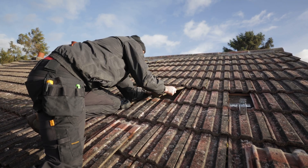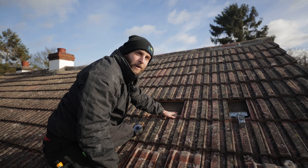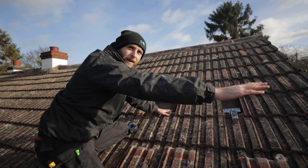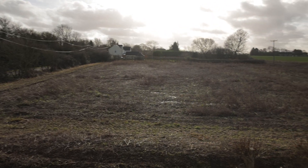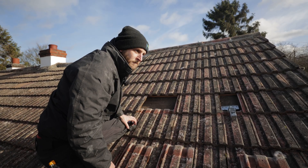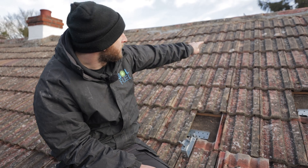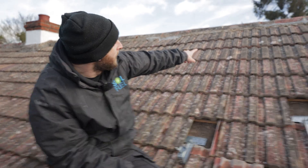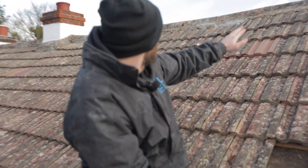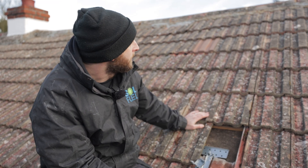So on the edge of the roof, we're over 300 in anyway. We like to put two brackets a bit closer together, just because the wind's going to be slightly stronger coming in from that way and it's quite flat over there. So two close together on the ends, and then we can go back to our normal spacing in the middles. We're going to shift them down slightly just so we haven't got to disturb that second tile up there, because I don't want to disturb the ridge — it's already looking a little bit old. It makes no difference to us, just haven't got to touch that up the top.